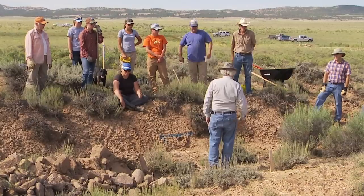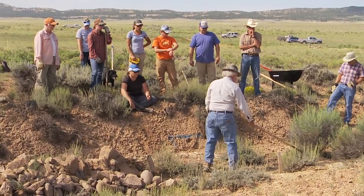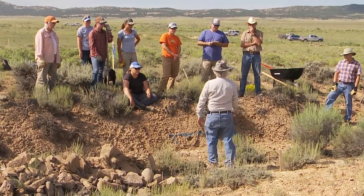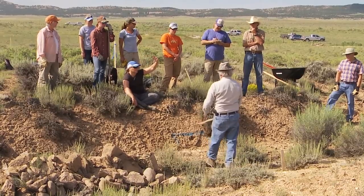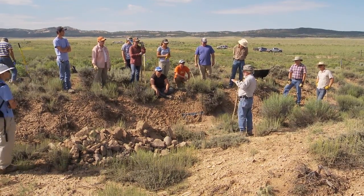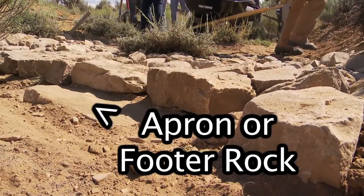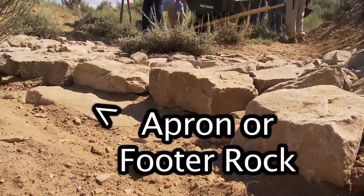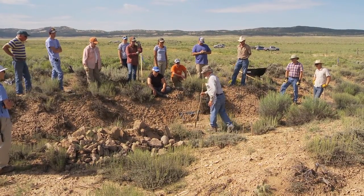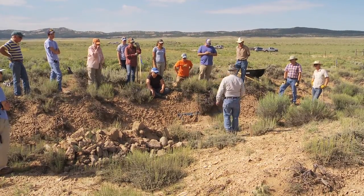I usually like to have this flat to about here, and then these rocks on this side be a little higher than the bottom row, so on both sides. The reason for the apron is when the water falls over this layer of rock, it splashes down and it will dig a hole. This is down to a rocky layer that would be deeper than it is now.